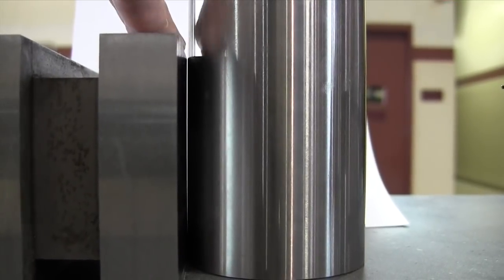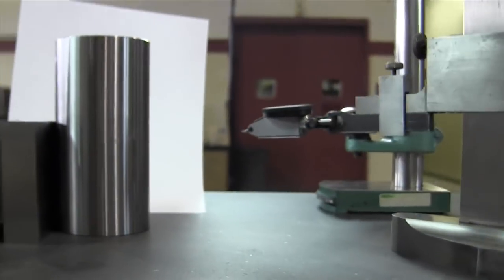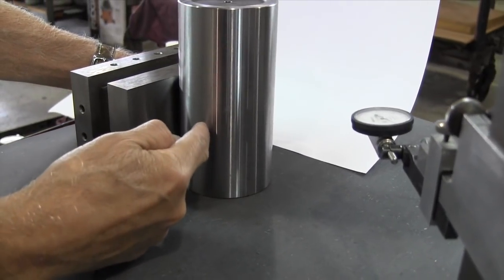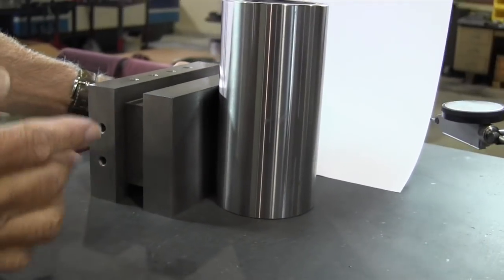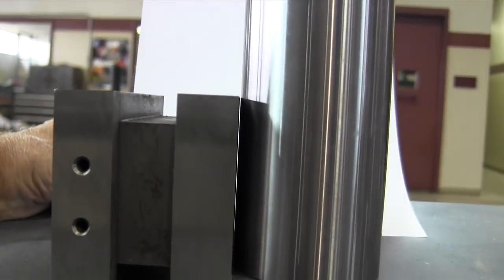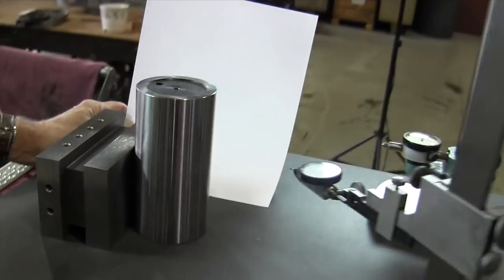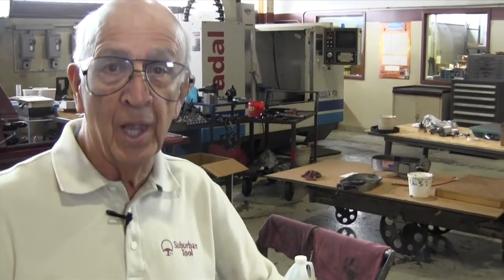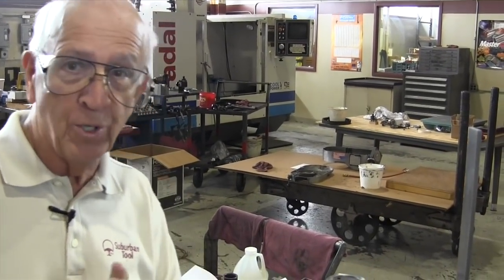If you've got good light in your shop you're good. I can drop this paper down there — we know this paper is about three thousandths, so we know we're off at least three thousandths. If you put the paper behind the part and take a look, you can see the light in there. It's important that you are parallel to this surface when you're looking inside — I'll show you why. Get your eye lined up exactly parallel to the surface you're checking.